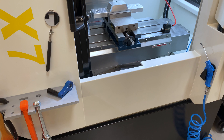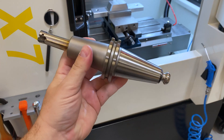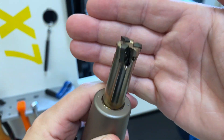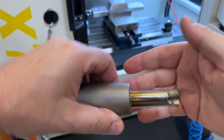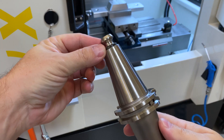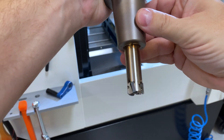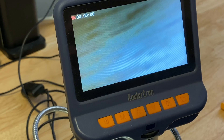This is my Kyocera Mini Raptor — I think that's what it's called — and it's a feed mill that I bought for the super mini mill we once had. What's nice is this doesn't put a lot of lateral load on the spindle; it puts the cutting forces up vertically through the axis of the tool.